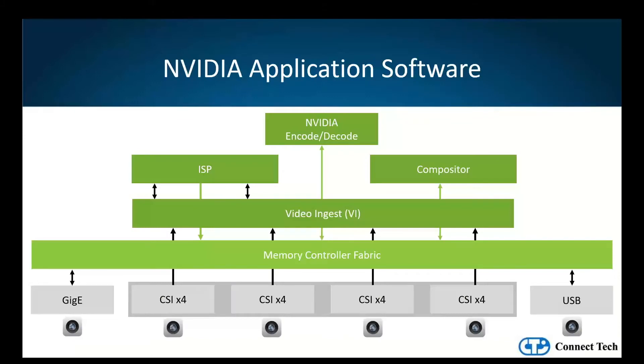Before discussing the various camera interfaces, let's detail from a high level the video capture and processing pipeline. This pipeline runs from the sensors ingesting MIPI, USB, Gigabit Ethernet, and PCI Express vision data to the decode level with ISP, H.265, and H.264, to the GPU compute running CUDA, CNN, and DNN models. From there, they run to encoding with OpenGL, H.265, and H.264, and then to the output, whether it be display, storage, network, or other interface.